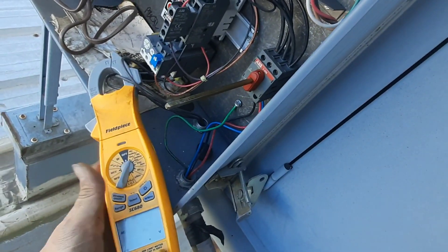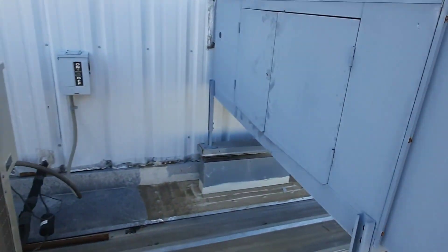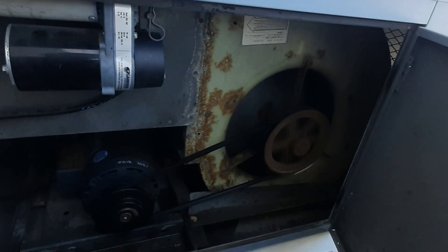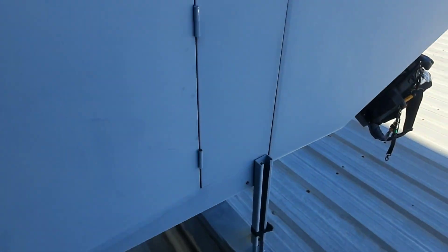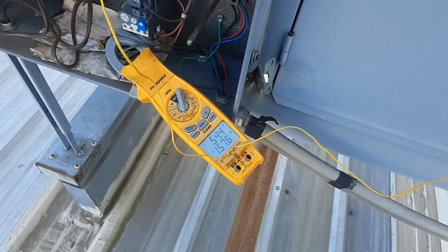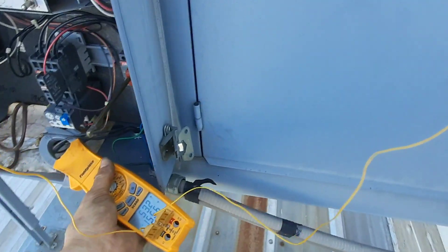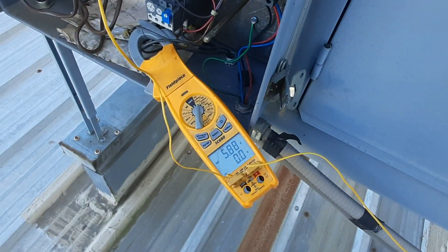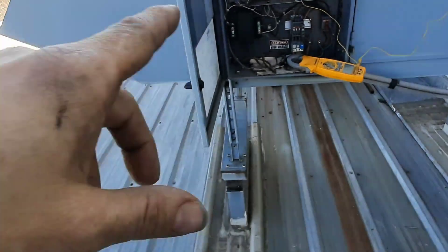Temperature's back down. I'm gonna turn the burner back off and start cleaning up, then let that guy run. I'm happy with that, as long as it doesn't creep up. The bearings are kind of what they are — the motor's gonna die eventually, they know that. It's not slipping. There might be a little wobble on the bottom, but I'm pretty happy with it overall. We've had it running for a little while — we're maintaining right about the 155 to 160 mark. The burner's modulating, everything looks good, and the amp draw is right at six amps — actually dropped a little bit.